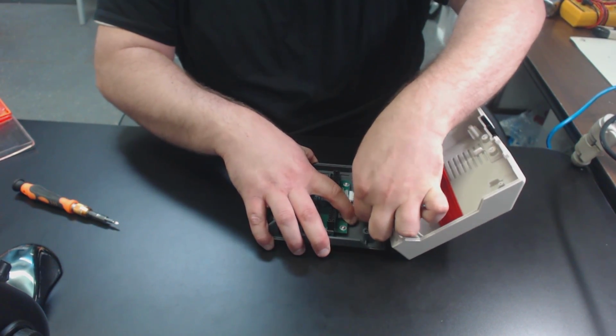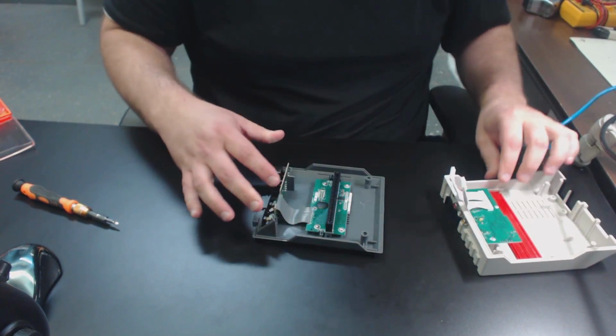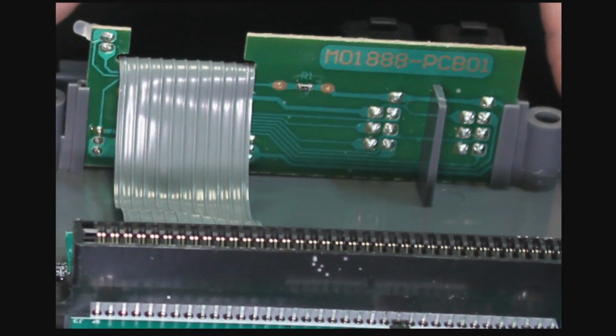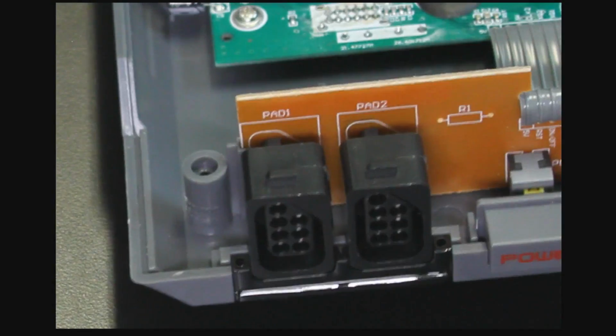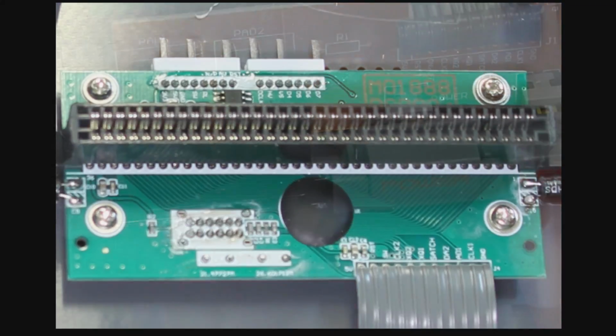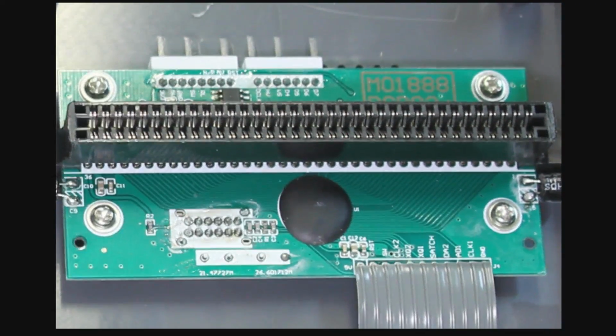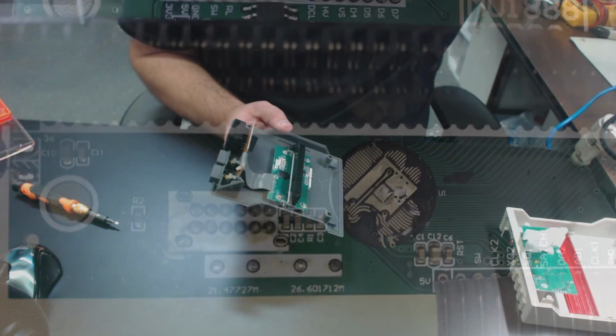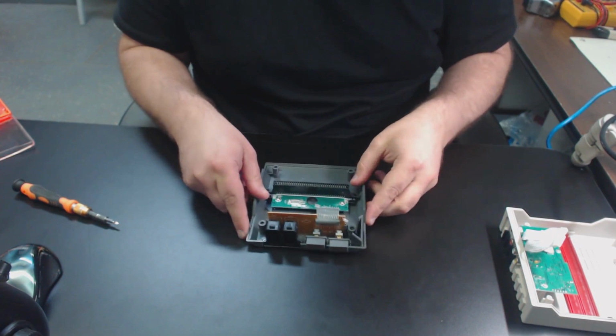Let's see if I could unplug these to get better zooms. So this right here, it's just the PCBs for the power, reset, and controller inputs. That's exactly as expected. It looks like this glob top circle right here is the Nintendo on a chip. That's an entire Nintendo console all on one ASIC. It's most likely the same exact chip that's been around for over 10 years and in all the other crappy Hyperkin NESs. Well, let's get this thing apart even more and see what's underneath that.